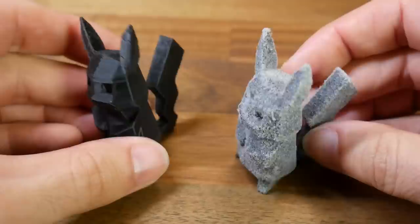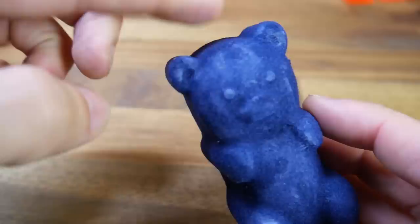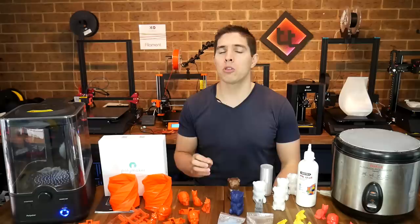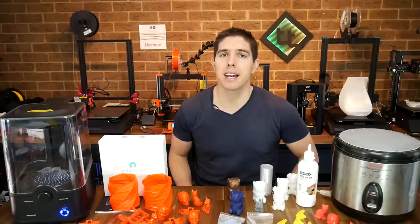The finished result is not too bad. If I had used a lighter colour with this method I think I would have got a pretty good result — it definitely feels fluffy to touch and the flock is stuck on quite well. For my final attempt, I drilled out the applicator to have 3mm holes and tried doing multiple layers of flock and glue. The result is still patchy, but once again there are some pockets that are absolutely perfect, and if I could get them evenly around the whole thing it'd be a really good result. I haven't perfected this technique, but I really think there's something in it if I experiment a little more. I wondered whether it would be good to have some liquid glue to dip the part in and then a big bed of flock to dip it in straight after. I'm excited to see where the community can take this.